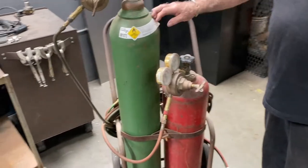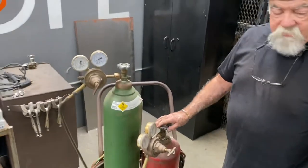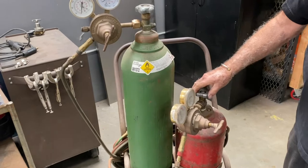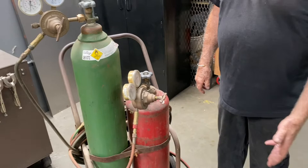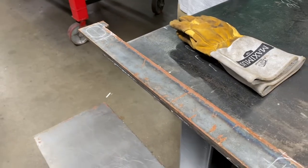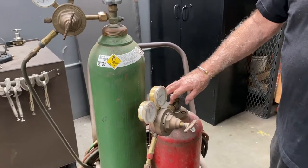This is the volatile side of oxy-acetylene — it's the propellant for the flame. What you want to do is you do not want to open this all the way; you only want to open it up a quarter turn. Because if something happens — you blow a hole in your hose or something breaks — you don't have to stand there and crank too much on your shutoff valve while it's burning the house down.